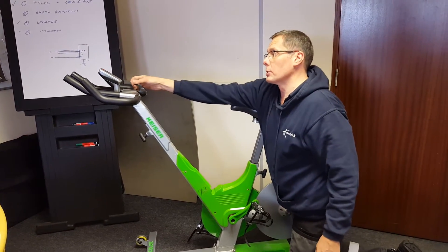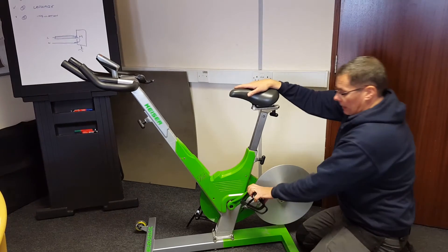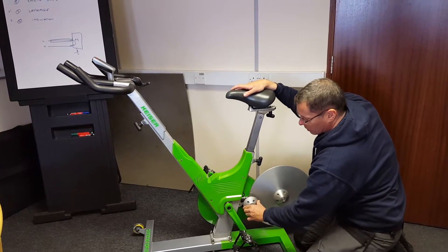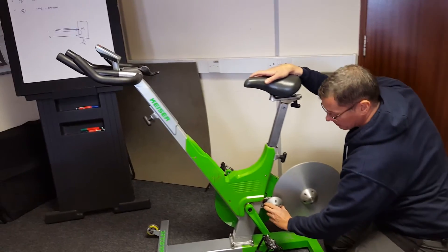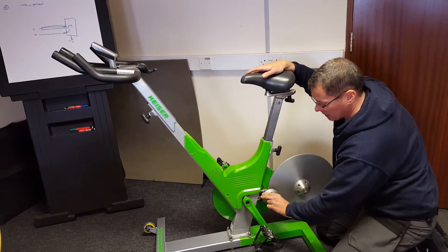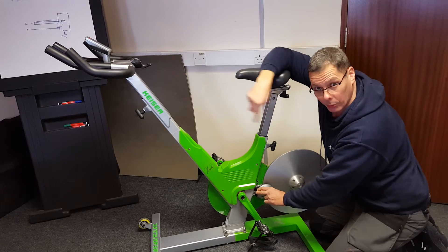My gear resistance shows position 24 on there. Before I get into recalibrating the potentiometer, I'm just going to check that I've got the full range of movement available on the spindle here. You can hear it click against its mechanical stops when you turn it, and you can feel the resistance of the spring on your fingers.